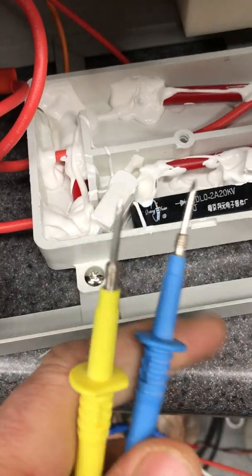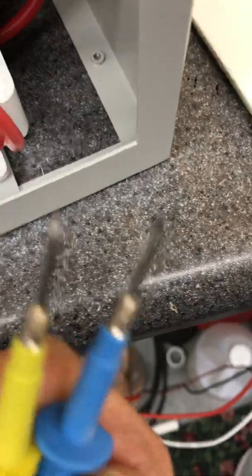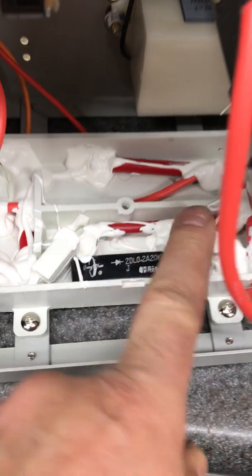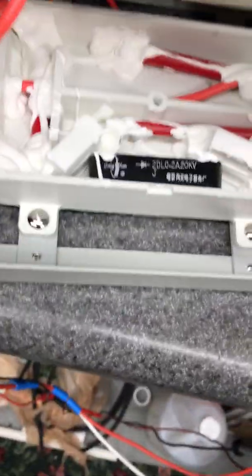And I could take the meter and measure that. So what I'm going to do is dig out some of these resistors. I have some really, really sharp probes. I know I bought them at a hamfest or a swap meet or online or something years ago. But super sharp. These needles are needles. So that'll be perfect for diving into there. I'll plug that into my voltmeter, do some troubleshooting, and hopefully I can find the problem. I doubt I can get replacement parts, but it's not the end of the world if the DC doesn't work. I mean, worst case, I can build another rectifier for the AC and get higher voltage on the DC side or something. So, okay, wish me luck.